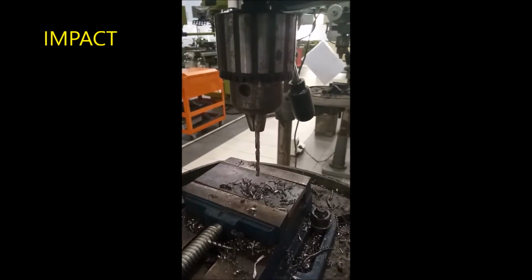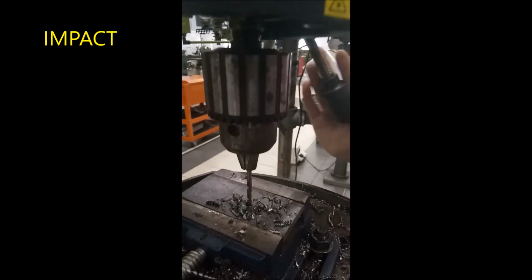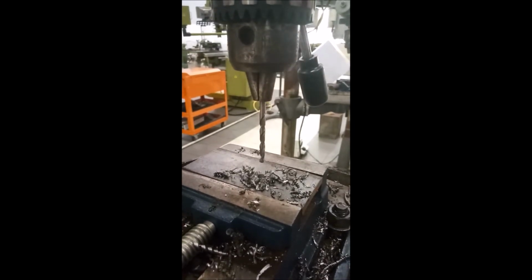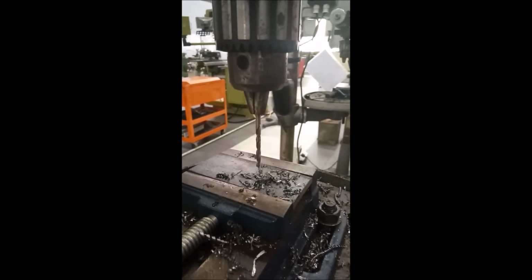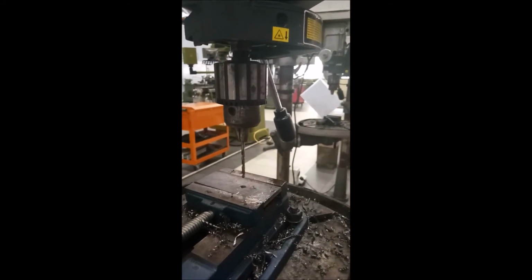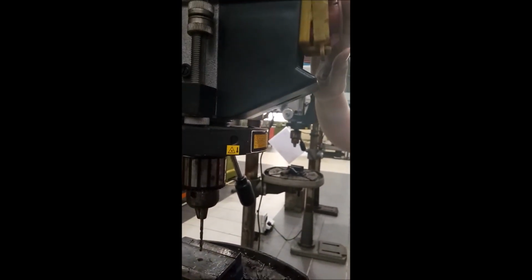When drilling holes in workpieces, we shouldn't drill continuously as it will damage the drilling tools and workpiece. We can adapt this standard by raising the bit frequently when drilling deep and cleaning the chips out of the hole. This will keep the drill from wearing down, breaking, and flying out. If the drill does get stuck in the hole, turn off the machine before you raise the bit. The same goes for the milling machine.